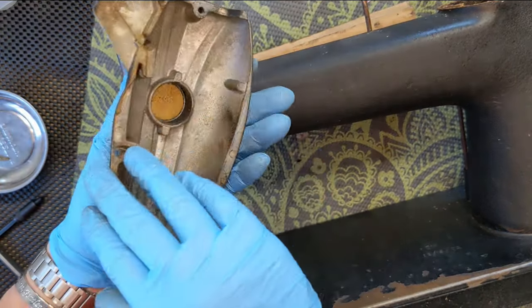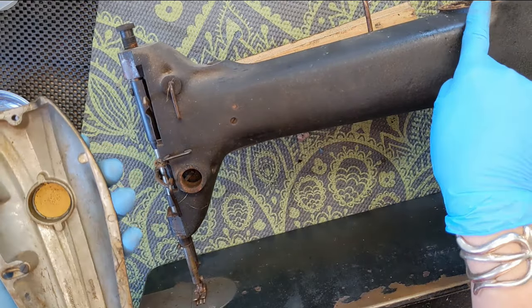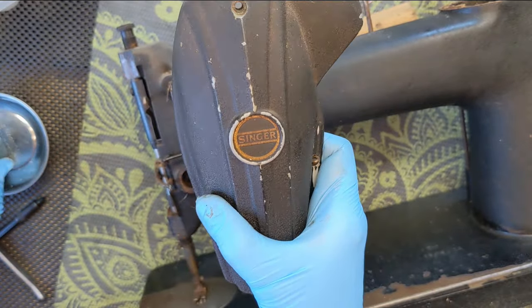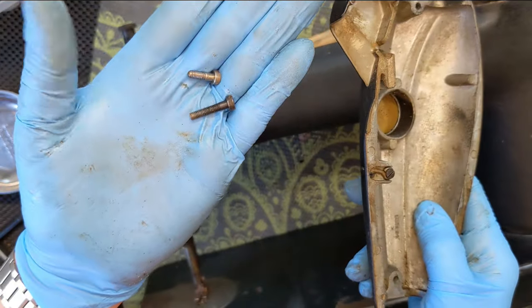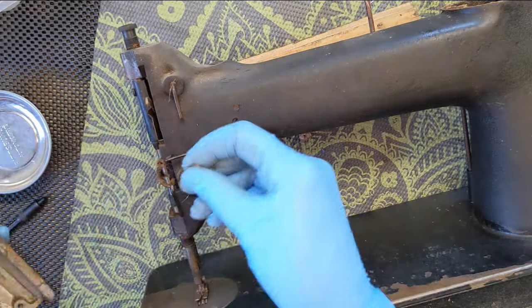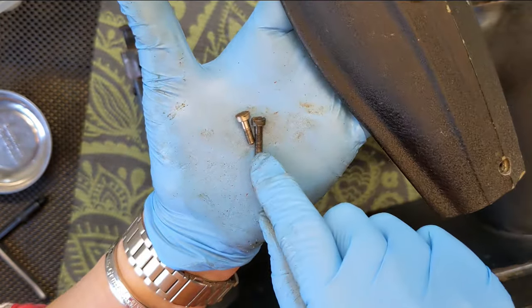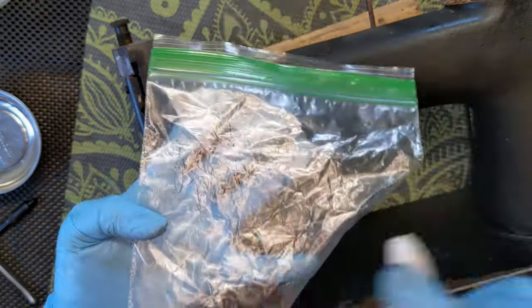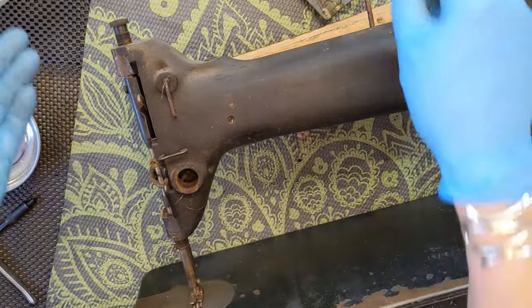So I've got the little front piece off — it's cast aluminum. There's actually a cast aluminum piece that was right up here on top that I've already removed just because I was curious what was going on in there, and I've actually stripped it and primered it already. I'm going to do the same with this because it's so nasty — it's going to have to get totally clean. Here's the little screws that go with it. I'm pretty sure the shorter screw was on the top and the longer screw was on the bottom. I'm going to be putting these two away separately. I wrote 'front plate' on my little baggie so when I come across two random screws later, I will know where they go.